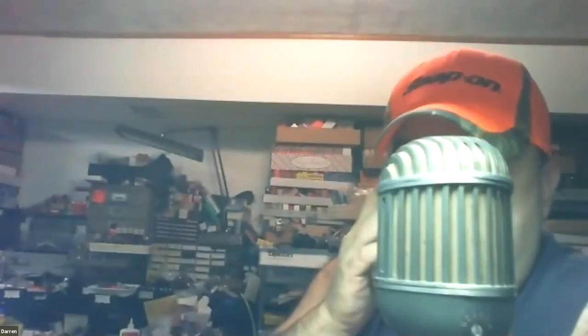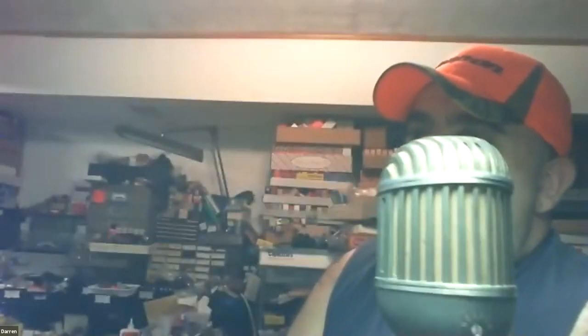It reminded me, there was some razzle dazzle, remember, with 50B5 and 50C5 and the pinouts. If you put tubes in the wrong way, that's why they took the 50B5 and made the 50C5 out of it. Remember that? There was some screw up there with UL. You could plug the tube in the wrong socket and have a shock hazard. Because those AC/DC sets didn't have any existing shock hazards. Yeah, right. It didn't have enough.